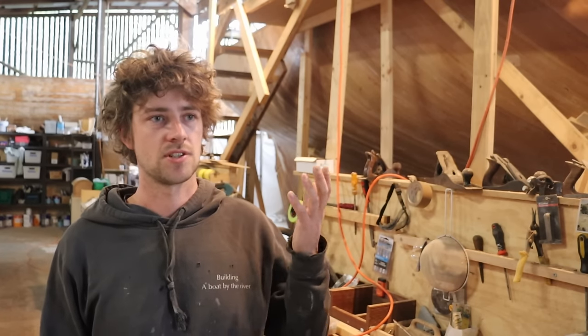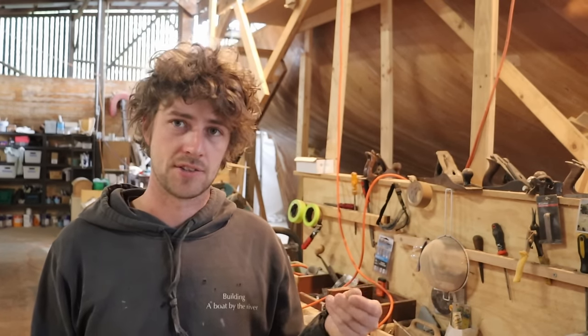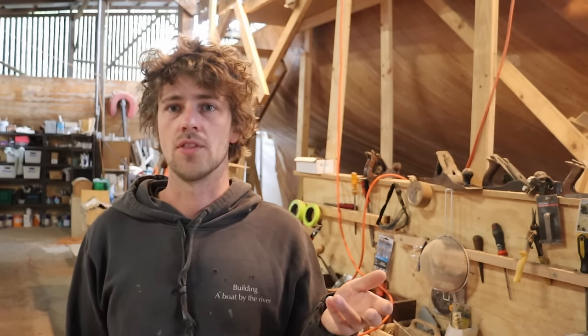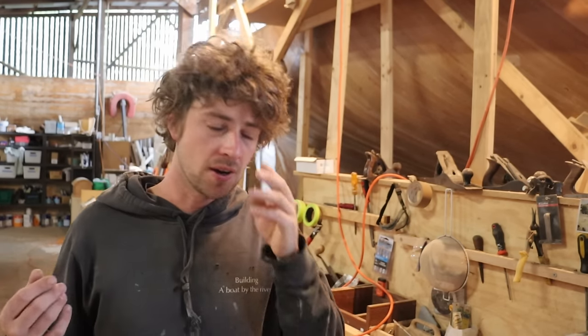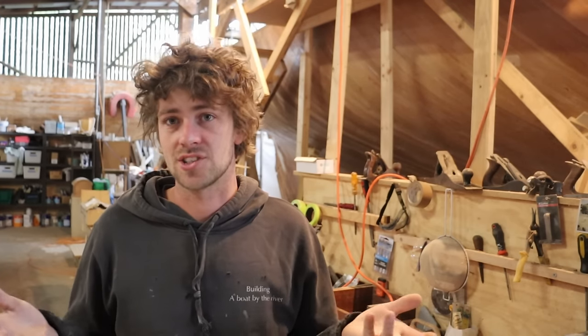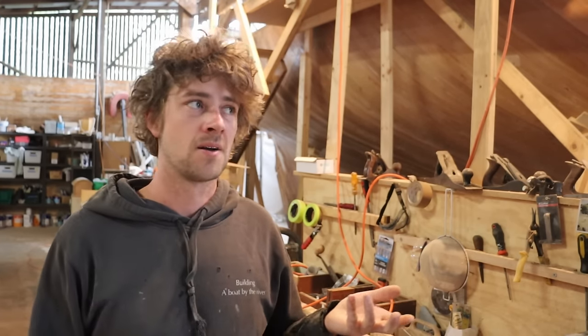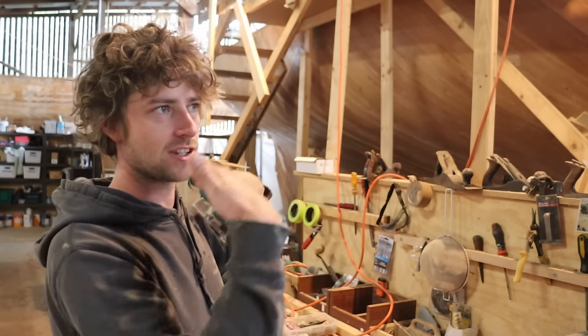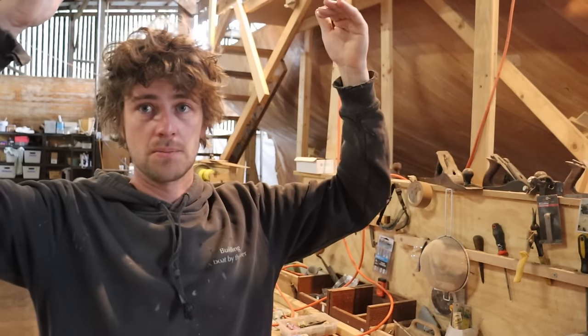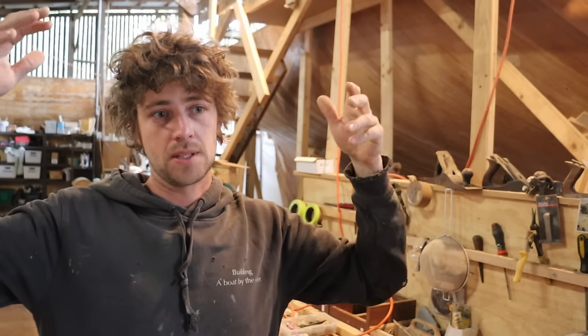But what happens is our celery top wood, our deck planks, are on the ground, racked up, and they're absorbing a lot of this cool temperature, you know? So the moisture's in there and it sort of stays there. It doesn't dry out throughout summer. Whereas up above on the boat, upstairs, it's very hot. It's basically a desert, and we have light coming through and tin on top, so it becomes a big oven. But that doesn't get down to the floor, down to the concrete slab.